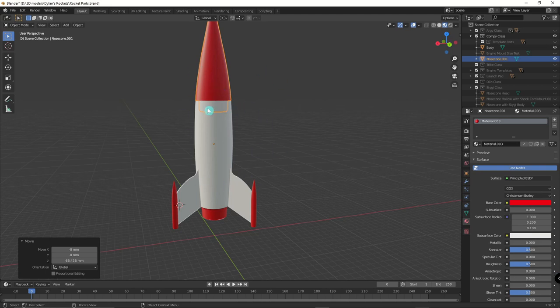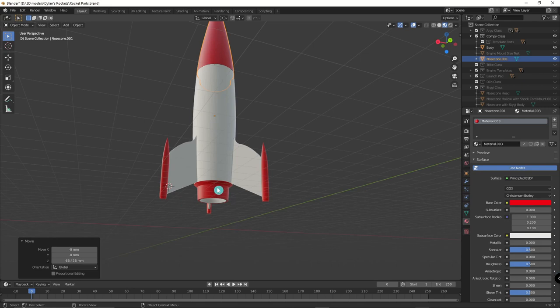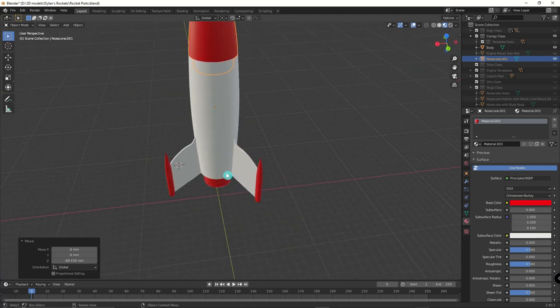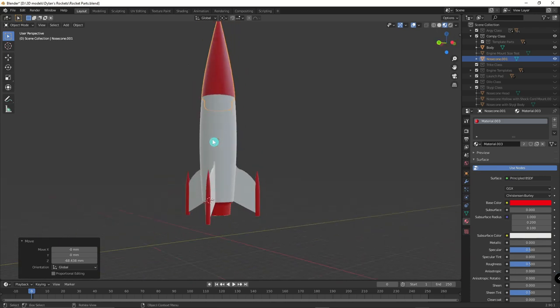It may not have been large enough for the weight of this rocket — about 195 grams with the engine, the wet mass. So it came down under insufficient chute control, hit the ground fins first. As soon as it hits on one of these fins, it puts a lot of stress and strain on the thinner part and it just snapped off. That's okay — I can glue it pretty easy, which is what I did with Compi 1 and reflew it.